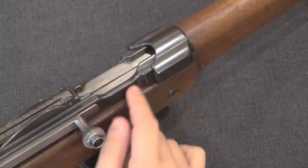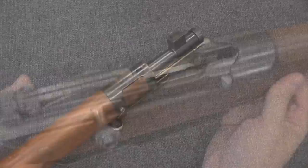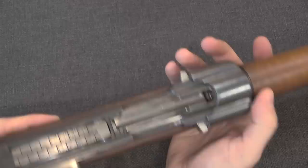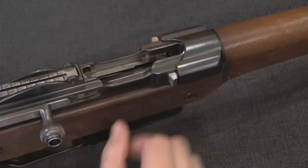The elements at play here are the recoiling assembly, which consists of the barrel — when I cycle this back, the barrel actually reciprocates along with it. That's full travel. I have this locked open on the empty magazine follower. So we have our recoiling assembly, our front trunnion encasement — I don't know what the technical term for this would be, because it doesn't really exist on a lot of other designs — and then the actual locking flaps themselves. You can see here that they're actually loose, and if we look right in there, you can see the inside of them.